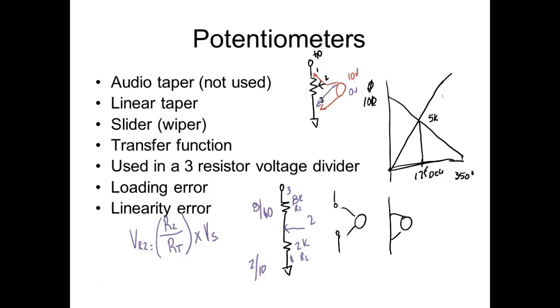That's what's nice about the voltage divider formula. Back in DC, if I'd given you a series circuit and you calculated the voltage drops, and I said, okay, let's raise the voltage from 10 volts to 20 volts, what would you do? You'd recalculate the current, you'd go back and multiply that through. But once you've established the ratio of a resistor, those resistors will drop the ratio no matter what the voltage.